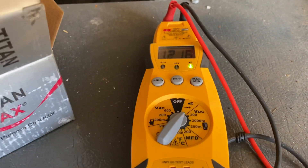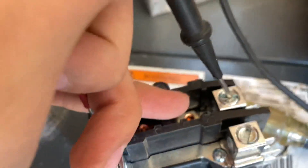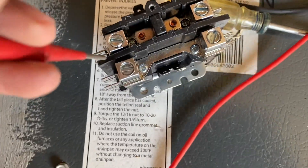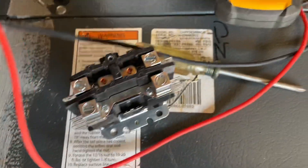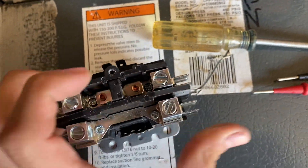You can see that — that's good. Your actual contact end is not stuck down, which is what you want. You don't want it stuck closed. And then this other side should already have continuity because it's already connected, so you check here — and that is good.